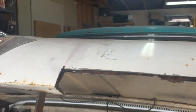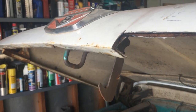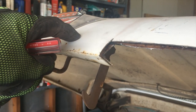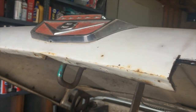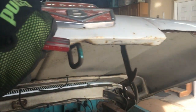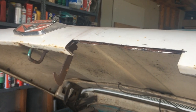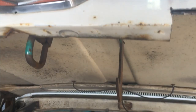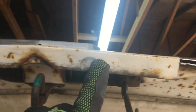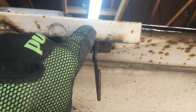We've cut it out and this side looks pretty good. The inner metal is a little thinner than the outer, but I've got a little bit of rust over here, so I'm going to dig at that a little bit. I might come down a little further and open this up just a bit more to make sure I've got all the rust. Everything else looks okay on the rest of the hood. I've decided I am going to take out some more metal — there's a spot weld there and a spot weld there, so I'm going to get a drill bit and drill these.